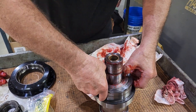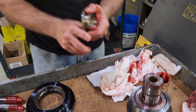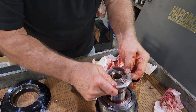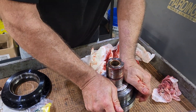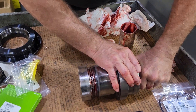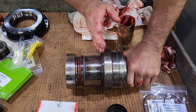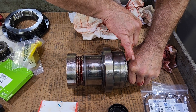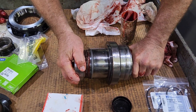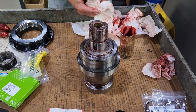This is going to go right on here. And this is called a spacer bearing. What this does — this preloads that whole thing. That sets your bearing preload. So if you're putting new bearings in, we're going to check this after we get it together. You may have to grind the shoulder or the face of this spacer to get the proper preload, but most of the time you don't have to do that. It's good — that's ready to go inside the machine.